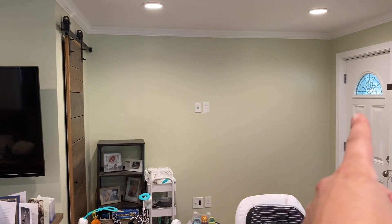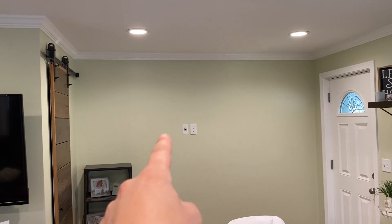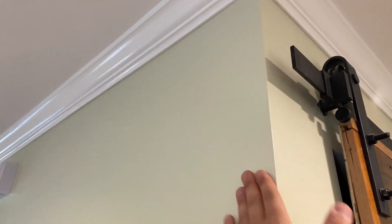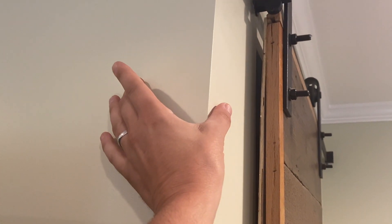So this wall back here runs the same way as these joists, and I know that that is not a load-bearing wall. But there are exceptions, because now I've turned this into a load-bearing wall because that beam sits right here. I could remove this wall up to this point because my post is right here — that is actually what's holding that beam up. So it can be difficult to tell, and of course if you have a second floor, it can be even harder.